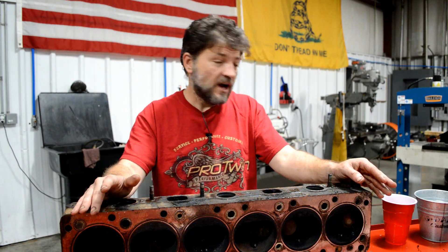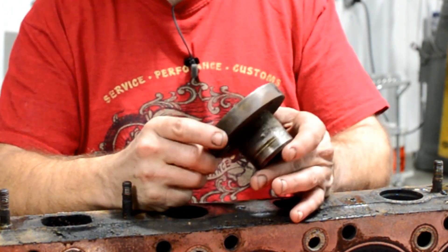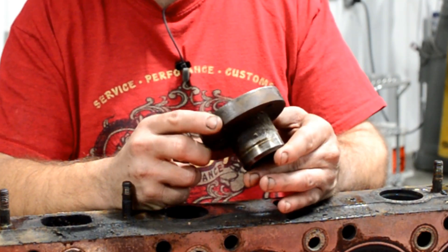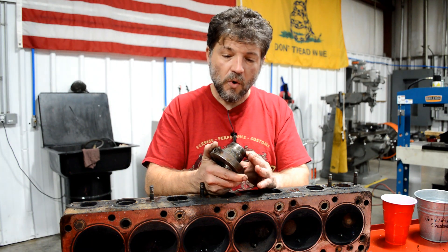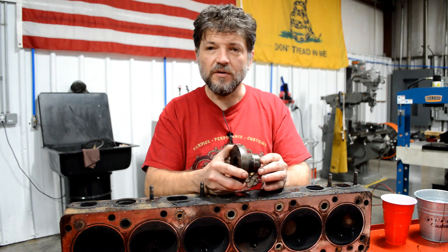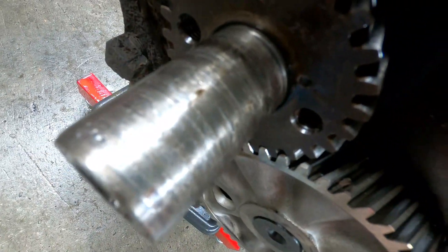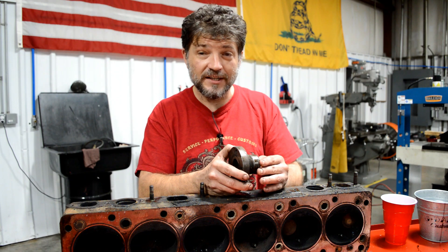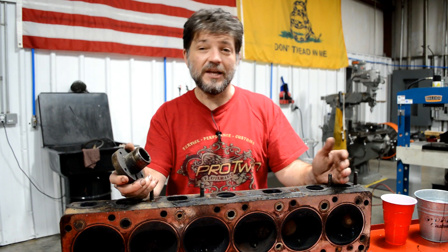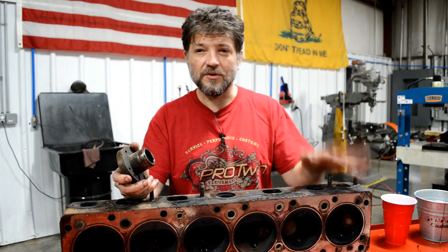The only other problem we still have to address is this hub. Someone made this modification as an attempt to repair it, which I'm not sure why they did it that way — it would have been relatively simple to just have another hub machined with a slightly smaller ID for the crank. More than likely we'll be able to make a sleeve for the nose of the crank and then make another hub, and I believe that'll take care of that problem. We've solved the big question, so now we get to move forward with rebuilding this engine. Thanks for watching — take care of yourselves and each other, y'all have a great day.